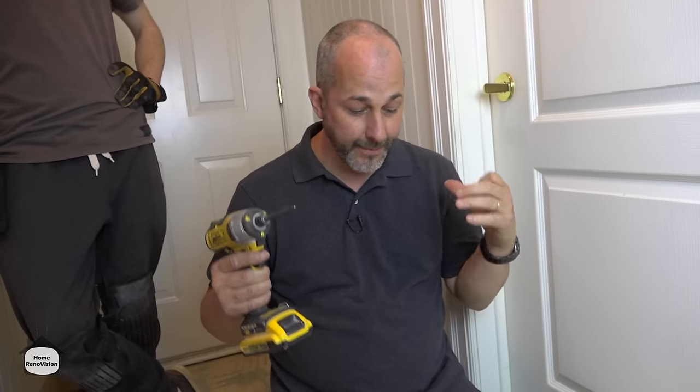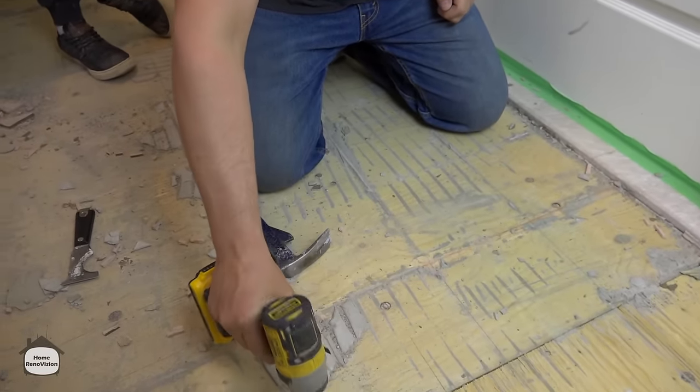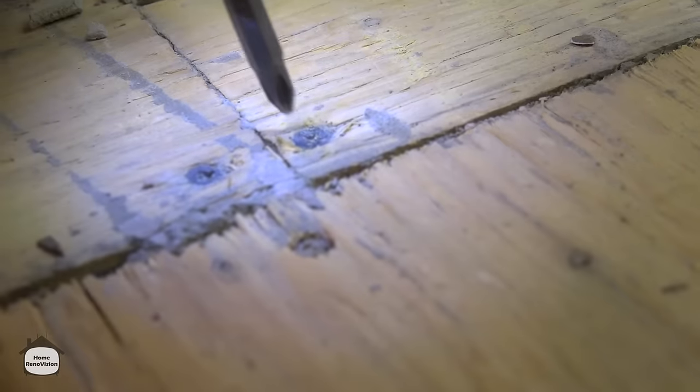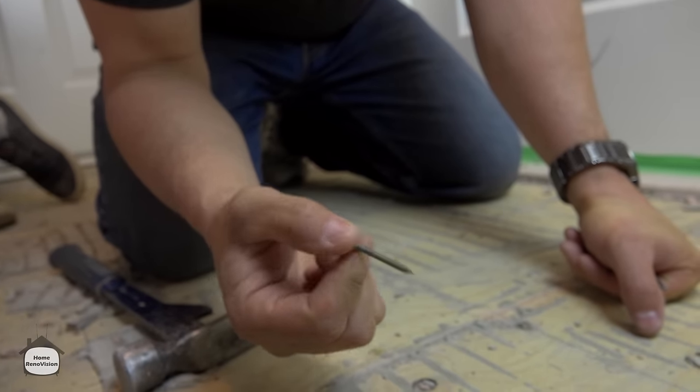It doesn't matter who you are or where you live — there are minimum standards for everything we do. This should have a lot more screws and it should be a flooring screw. It looks like a drywall screw, and it is. That is totally unacceptable. Even if it were a flooring screw, this screw should be longer because it's got to pass through almost an inch and a half of material including the vinyl, so it's just the tip of that screw grabbing the subfloor. Unbelievable — no wonder there's so much heaving. I'm wondering if maybe the subfloor is a lot more level than I originally thought and it's just the bad tile installation causing all this waving.